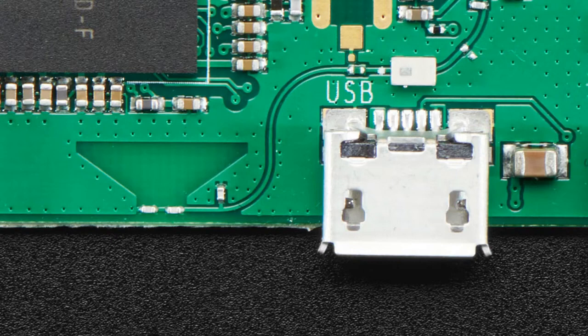Not only do they have the stamped antenna, but if you are doing a PCB and you're doing a lot of them and you want a very low cost antenna, I think it's probably smaller and gives you better results than an inverted F - although I'm not sure. I didn't look at the licensing documentation, but I assume it must be better because otherwise they wouldn't be using it. Check out ProAnt for licensing antenna technology.